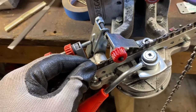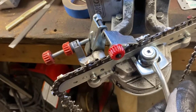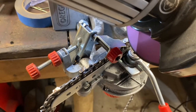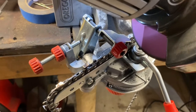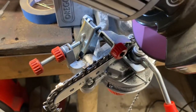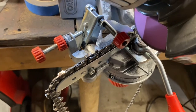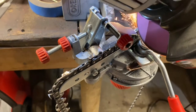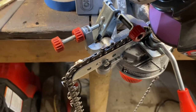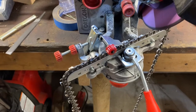After you're done, move on to the next tooth — pull it back, lock her down. Little taps — eventually you'll get to where she starts going down nice and easy. You don't want to heat it up; if the edge of that tooth gets red, you're going to have to file it to knock that ridge of molten metal down. That's pretty much it. I'm going to go through and do these and I'll show you how we turn out afterwards.